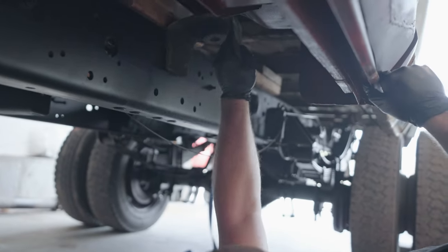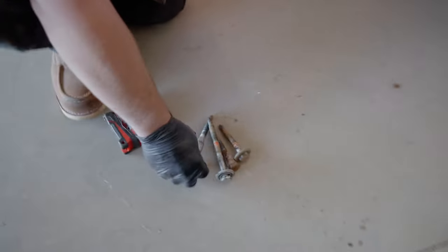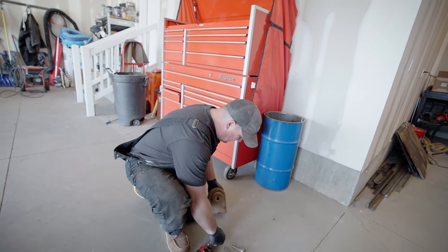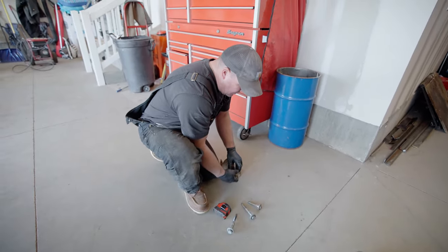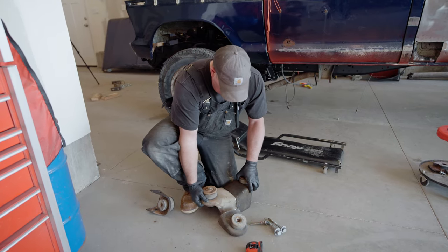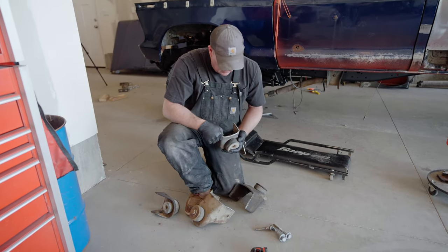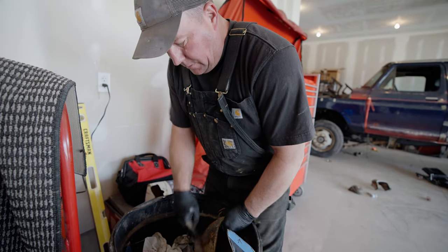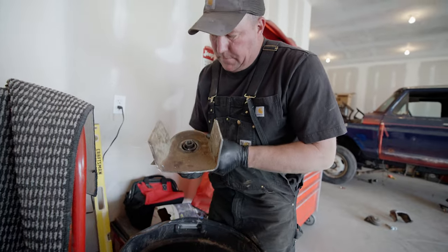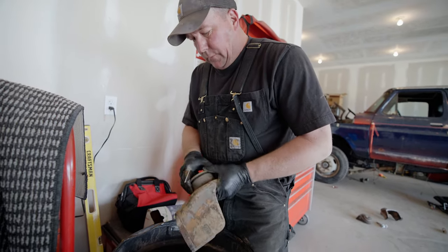In the back is that a front mount? I think it's a back mount — this is how it actually was. These are the bolts for the cab mounts and all four of them are different. These are factory bolts for sure. I think this one will work fine for a rear mount. We're close-ish — we just have to cut a bit off these, and we'll have to completely modify these to make them work for a front mount. I'm going to clean up this mount so we can make a mark and know where to cut.